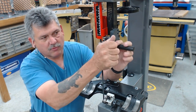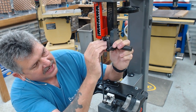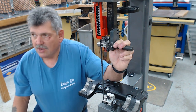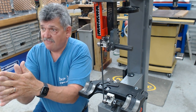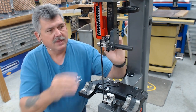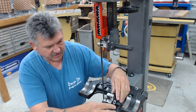You may need to re-loosen it to bring the side guides up so they're just behind the deepest part of the gullet. Remember, the tooth set begins at the gullet — if you bring those side guides into the gullet, all you'll do is flatten the teeth out, forming a knife edge, and the blade will seek the easiest route through the wood. We've got the top adjusted; now do the same thing on the bottom.